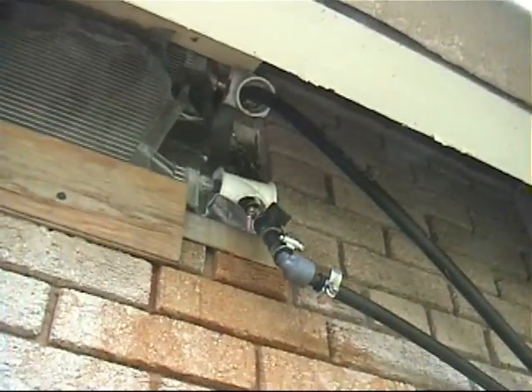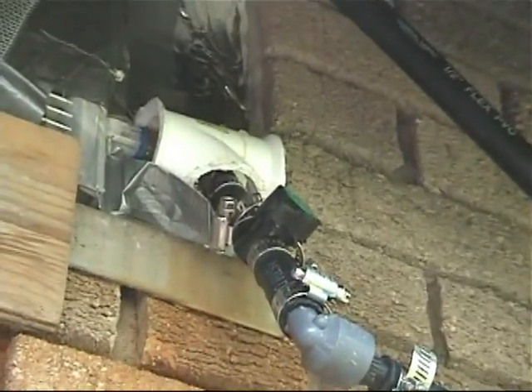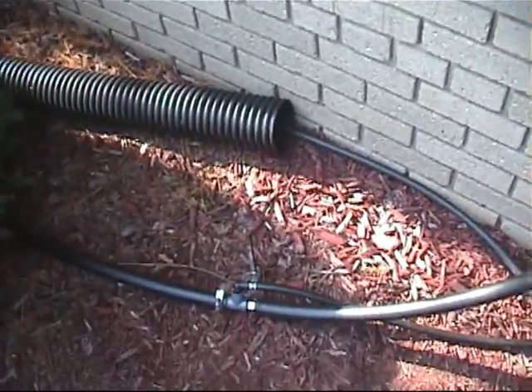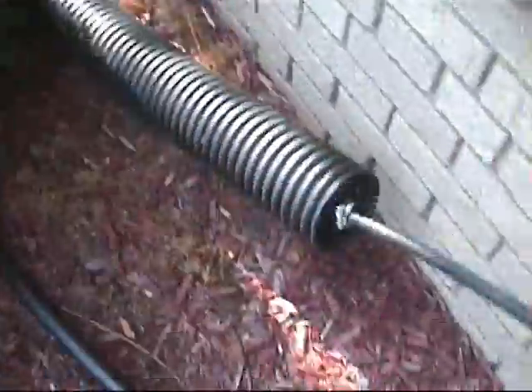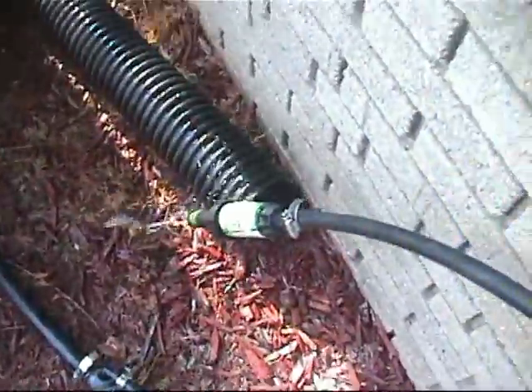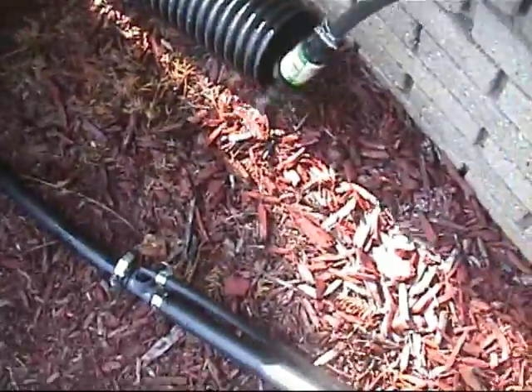It has an on-off valve, which is turned down a little bit. Here's how the water goes into the coil and out of the coil. There's some back pressure — there's actually a sprinkler head that's forced open, and they're adjusted different ways to provide some back pressure. Water goes into a drain tile to reduce erosion and take away the energy.